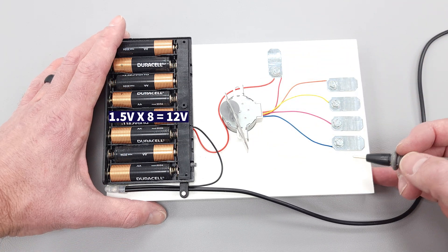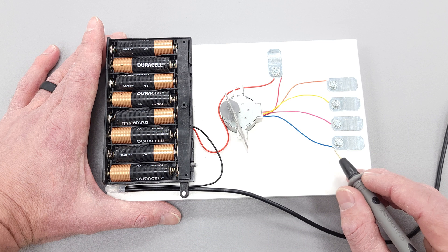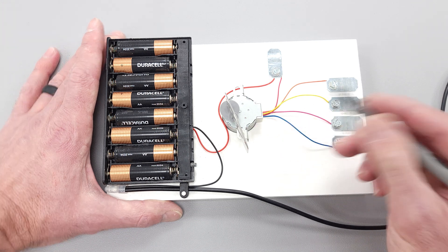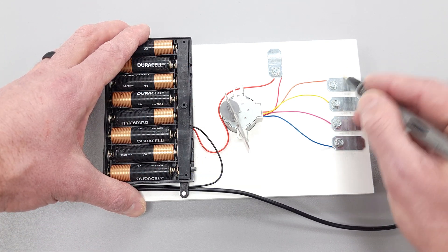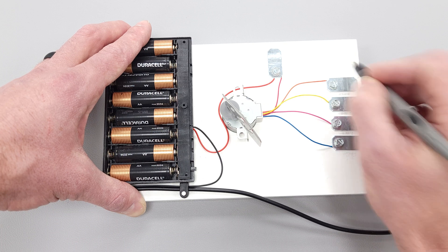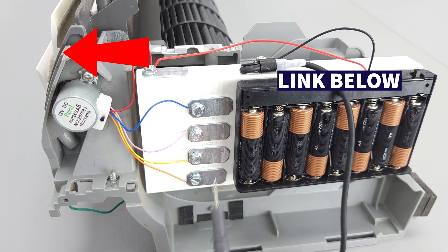You just need to get your sequence right. These are quarter-inch straps put in a vise and flattened down — they're rigid, which is nice — then screwed down with the wire sandwiched underneath. By scraping across each contact point, the louver blade turns. There's a small power switch here. As you scrape across each one quickly, you can see the louver blade actually moving, but very, very slowly — and that's what it does in a mini-split. You have 12-volt pulses turning this. We have a whole video explaining how a louver motor works, link in the description below.